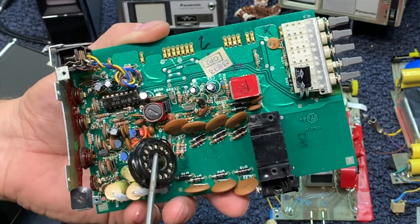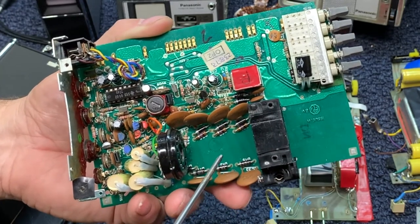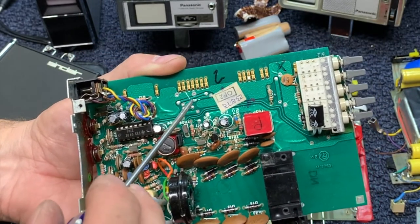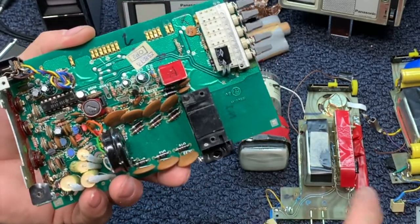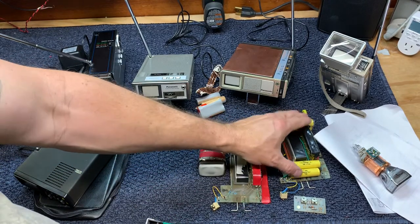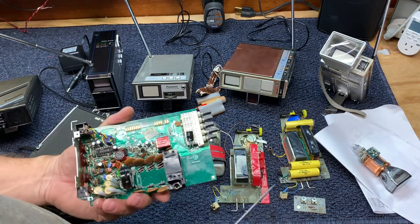This little transformer creates a 2,000-volt supply for the picture tube, an 800-volt circuit for the picture tube, two 300-volt voltages for horizontal and vertical deflection, a 45-volt circuit which feeds some circuits and transfers over to the tuner board, which uses the 30 to 40-volt range to tune channels. All of that is produced from these four to five volt NiCad batteries — approximately 4.5 to 5 volts depending on the state of charge.